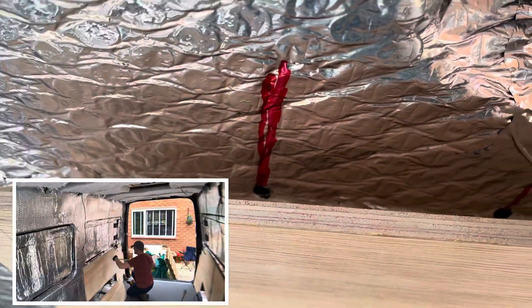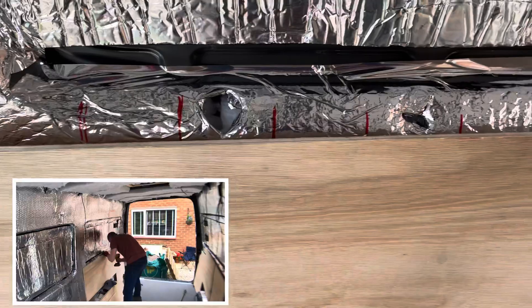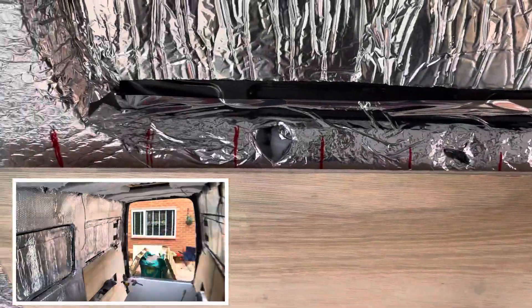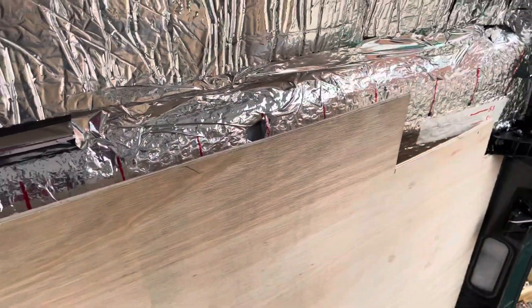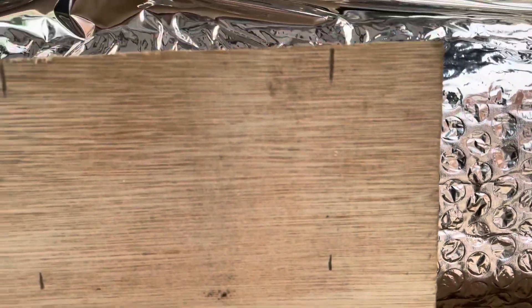I've marked off where each of the holes are. I'm then going to transfer that line onto the top and measure from the floor up to where the hole is, and mark out the holes where I'm going to bolt through. The holes are 10 centimetres apart. I've eyed them up from the red lines on the back, measured from the end to the first one to make sure I was on track, then went along 10 centimetres for every hole all the way to the end. I'll drill the first pilot hole, probably somewhere in the middle, and measure up to check we're on point.